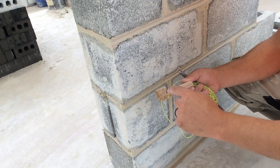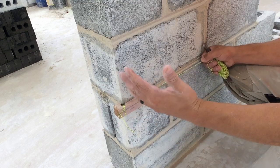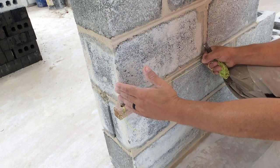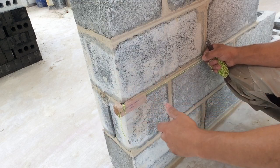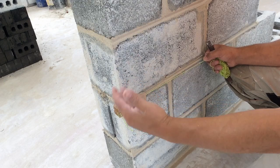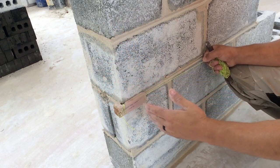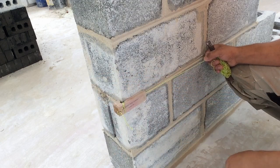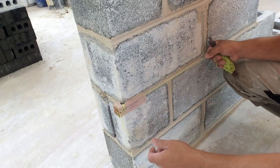The little circle machined into line blocks is actually pretty neat. It's for when we're using what's called jack lines in our building — when we're hitting an exact spot way up high on a building, usually with brick veneer, and we need to hit a certain measurement away from the building to work with the carpentry or roof above. We might hang a jack line from a lower course all the way to the top, and we might be running the building slightly out of plumb. That circle is so it doesn't interfere with the jack line when we're building a lead.